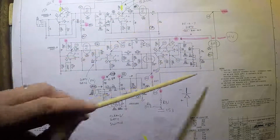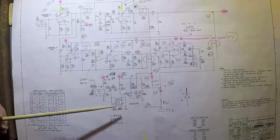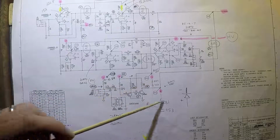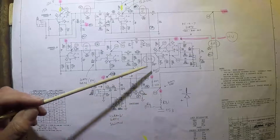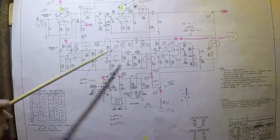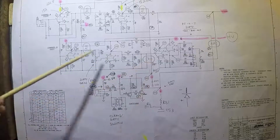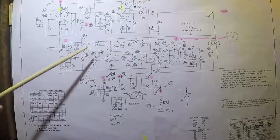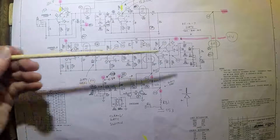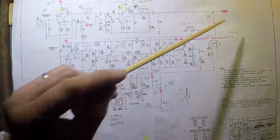And that's the same of all of these. And so I thought, wow, that's kind of neat. Why would they do that? Well, it's pretty simple. When you put the amplifier into the clean mode, what it does is it makes sure that these different opto-couplers that are in the dirty circuit are off. In other words, the LEDs are dark. And when the LEDs are dark, it increases the resistance so that the signal cannot flow through the dirty circuit and find its way all the way out over here, which is to the rest of the amplifier.